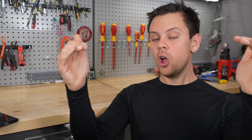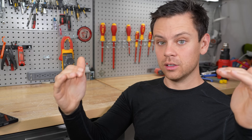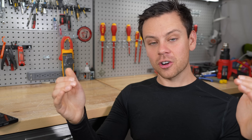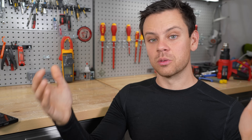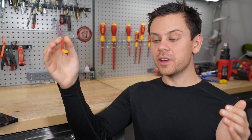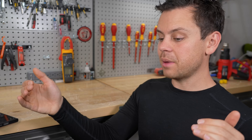With those voltages, you should get the full capacity for your cell. Now typically when you charge all the cells up, one of the cells will hit high voltage disconnect and it will disconnect the chargers. Then the voltage of the highest voltage cell will slowly settle — it will go from 3.65 volts down to about 3.32, then it will reconnect the chargers and try to charge again. During that time of charging, it is balancing: the highest voltage cell is connected to a resistor and it discharges that individual cell until it matches the other cells. Just because you have your absorption set to 14.5 volts doesn't mean it's fully charged when you hit 14.5 volts — the other cells can still be lagging behind. It will keep trying to balance over time, but sometimes this can take a long time, especially for cheap 12 volt batteries. Sometimes it can take a few weeks of cycling, but you'll notice that over time it will get more and more balanced.